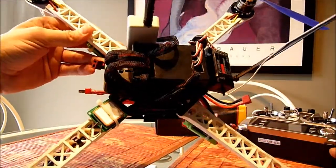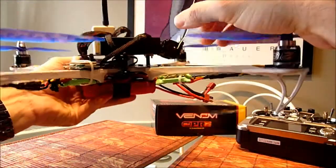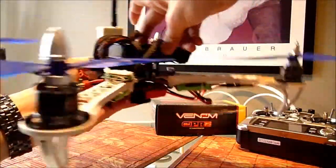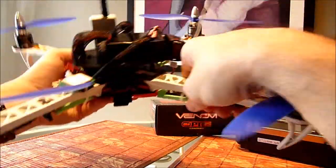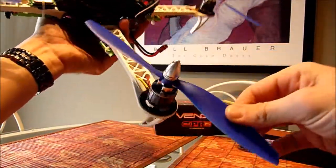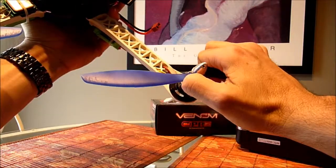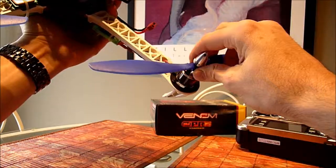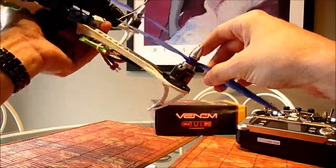Like I said, I have crashed it, and that's probably one of the reasons why — the board wasn't on there solid so it started to peel, and the craft would drift one way or another. It is very strong though; I had no cover on it and it bounced all over the place. One of the propellers here — you can see it's white from bending — it's still tough and hasn't warped, just a little strain from bending back. I wouldn't do long flights with it, but just for hovering a little above the ground for testing it should be okay.